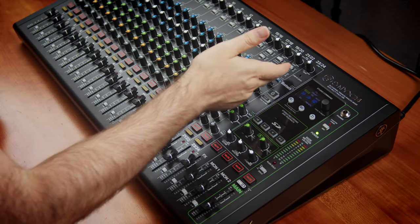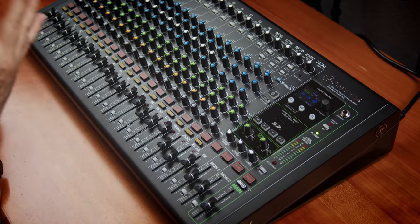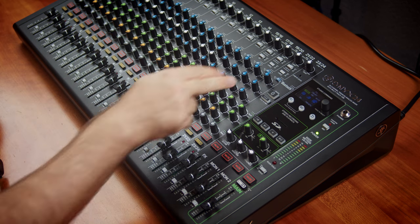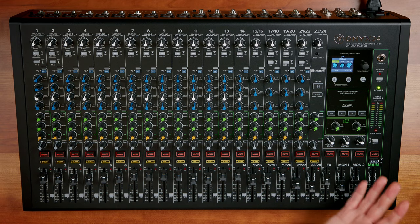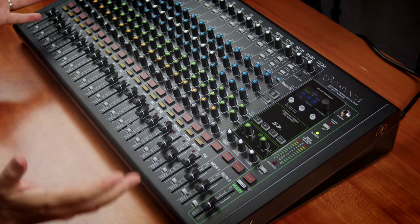If you want to be able to listen to anything coming out of Ableton or Logic or whatever your DAW of choice is, Bitwig, you're going to have to dedicate 19 and 20 as the main stereo out of that device, which is going to take up another track. Additionally, there is USB 3 and 4, so you can have four total outputs from the USB device. And again, it's going to be dedicated to these channels right here. So the last four channel strips are almost like wild cards, where it's not truly a 24 channel mixer at that point, especially if you're using these features,